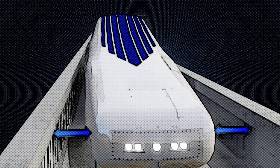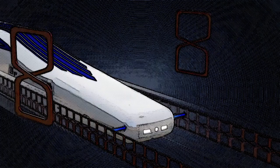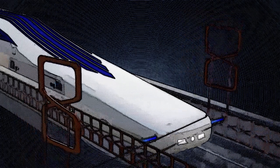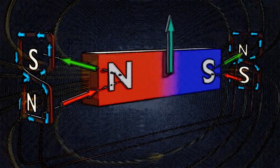It needs to have lateral stability. Japanese engineers achieved this by interconnecting the same figure-8-shaped coils. The electromagnetic fields in the right and left coils balance each other, and no current flows through the interconnecting coils, keeping the train in the center. However, unexpected events can occur.